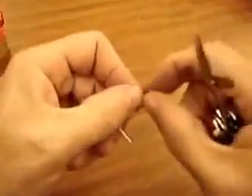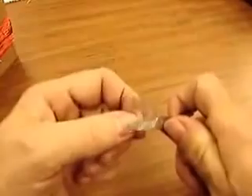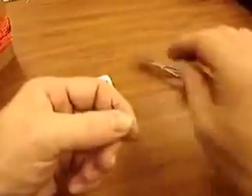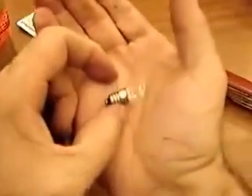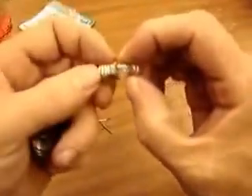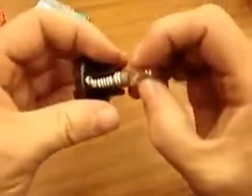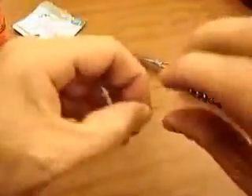Use a tiny light bulb — Radio Shack part 272-1139. You can't use normal light bulbs for this; it's a 1.5 volt, 25 milliamp bulb. From mail order you can use a number 48 or 49 bulb — they're the same bulb, just different bases. This is a 48 with a screw base, but you'll have to crank your generator much harder to get this one to light. The Radio Shack bulb is better — it's more sensitive.